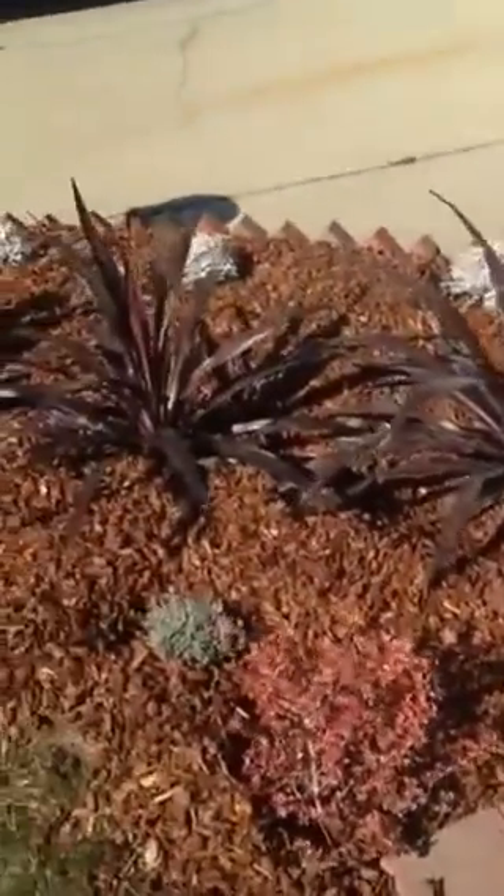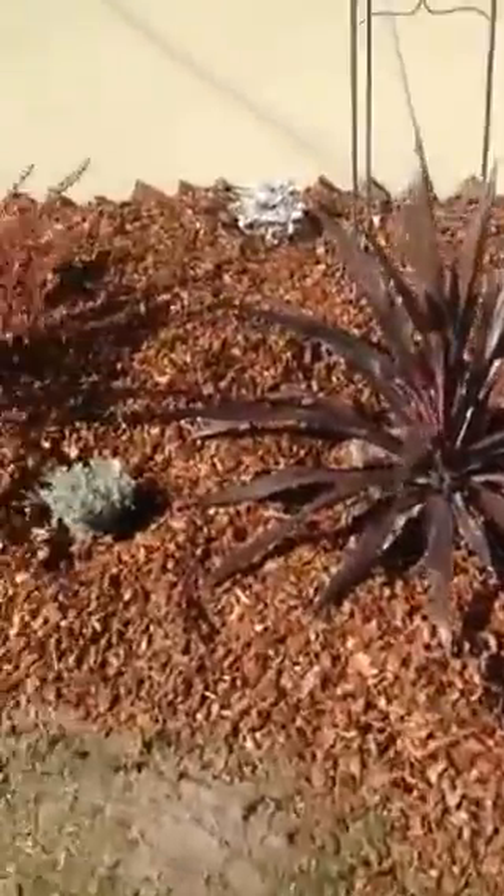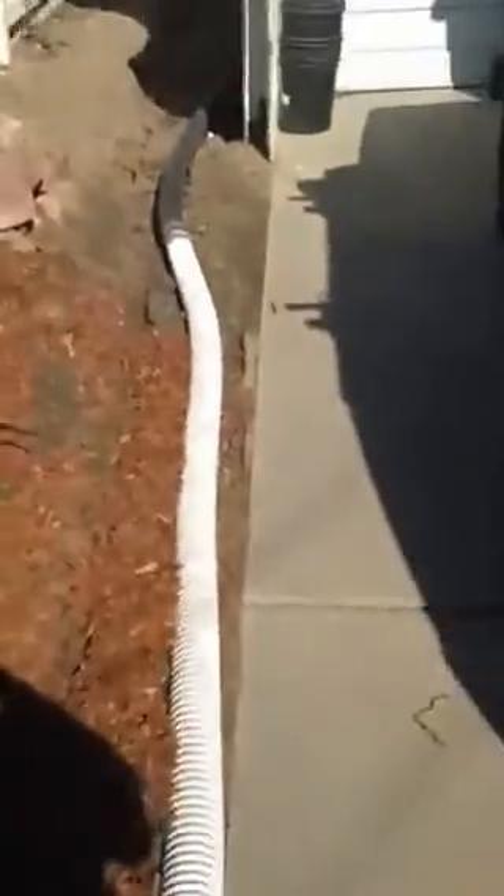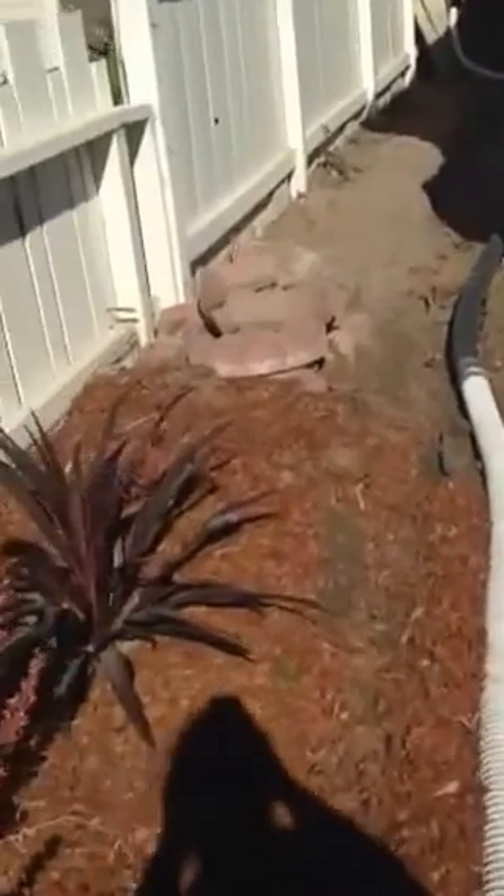Here's some more salvia, sages, artemisia, and sage. Going along here, here's the driveway showing the planting along the lawn side. On the other side of the driveway there's another hose from the back of the garage downspout — the landscaper dug a trench all the way to the end of the garage, 12 inches wide and 4 inches deep, and put pea gravel in. Everything's back-compacted nicely.